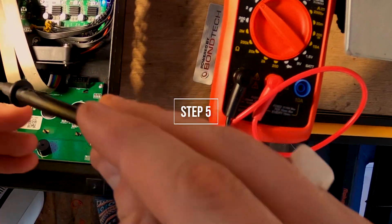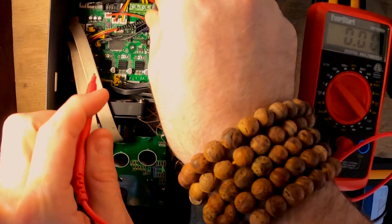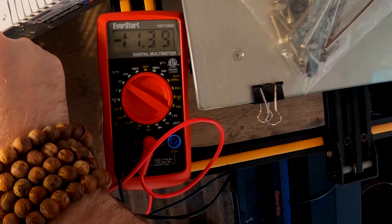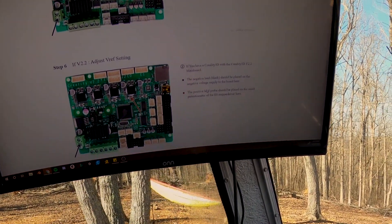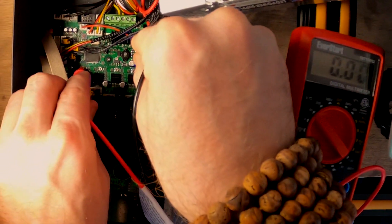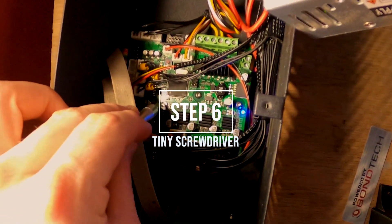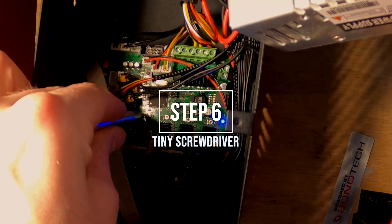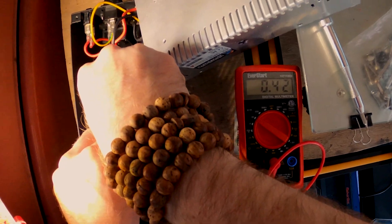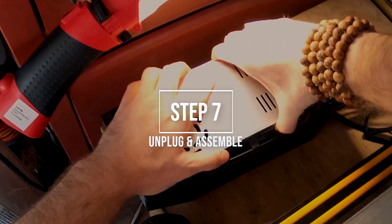What we're going to do is put the black side on this part and the red part on this little turning knob. I'm getting a negative value, so that means something's wrong. It actually turns out I have a newer CR10, so I'm supposed to put the black over here and the red right here. That's good, but we want to cut that in half. So now we're going to use a tiny screwdriver and just turn that ever so slightly until you get a reading of 0.42 or 0.4 is fine. Then unplug your printer again and put that all back together.